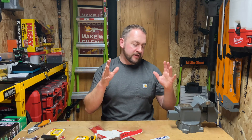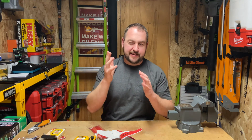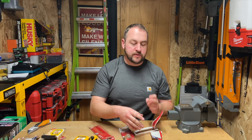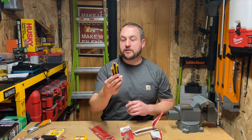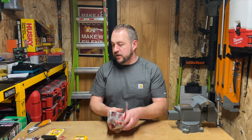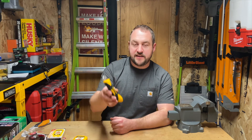They have a bunch of other blades as well - some with hooks on them for cutting carpet and different materials. Any manufacturer's blades within decent tolerance should be interchangeable: 18mm works with 18mm, 25mm with 25mm. They also make a 9mm that's really precision or craft-oriented, while 18mm and 25mm are geared more towards heavy-duty construction.